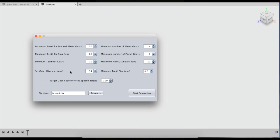That sets the outside diameter of the first ring gear, and the next one will be really close, but it could be larger or smaller than this number. Also, one thing you should know is that if you make your gears helical gears, this will be wrong. Your gears will be slightly larger if they're helical gears, because that's not calculated in this program. So this will get you close, and then you can multiply the module of both stages by the same factor to adjust it slightly one way or the other.